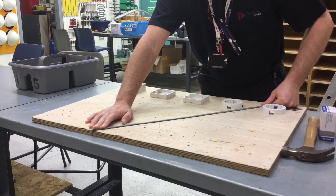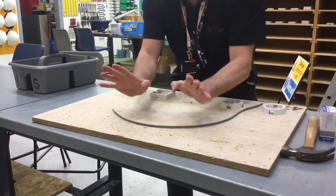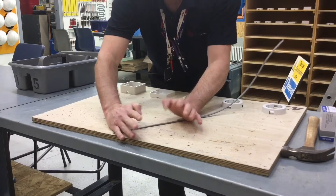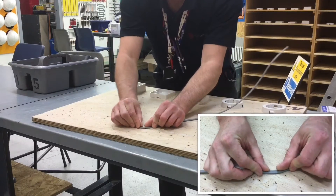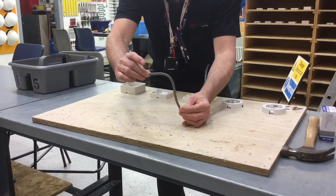For my exercise I'm going to need to put a 90-degree bend in at the top. Being the first time I've ever clipped PVC twin and CPC cables to a surface, I just want a nice smooth bend. We'll cover the bending radius and acceptable bending radiuses in a later presentation, so just make sure it's nice and flat and we'll look at doing this smooth bend. I'm going to take my fingers on the outside and my thumbs on the inside, somewhere near the top of the cable, leaving plenty to go down into the accessory. I'll pull once, then move my thumbs up slightly, pull again, and move my thumbs again — pulling in about three positions in order to get a smooth 90-degree bend.